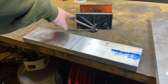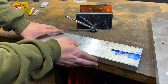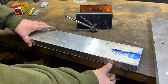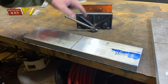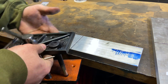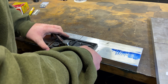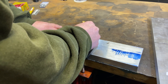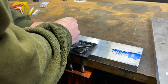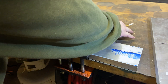Here's how I'm going to center this vise on the piece of aluminum. I drew out the center line, and as you can see this piece of aluminum is flush with my table. I'm just gonna back it off ever so slightly so that this aluminum doesn't interfere with any of the posts in the back of this vise. So I'm just gonna line up this vise with the center line and mark my two holes.